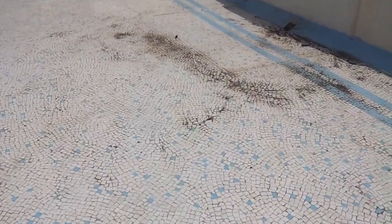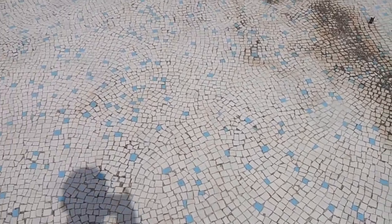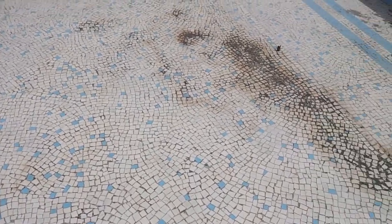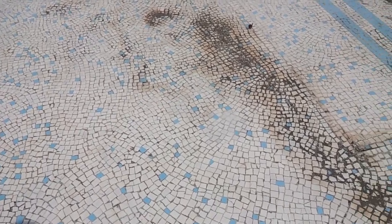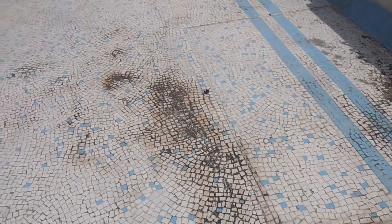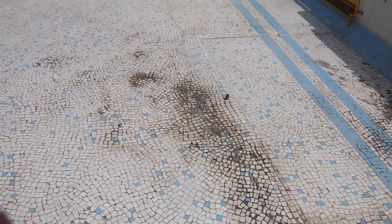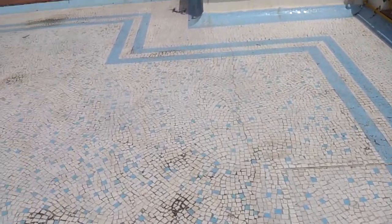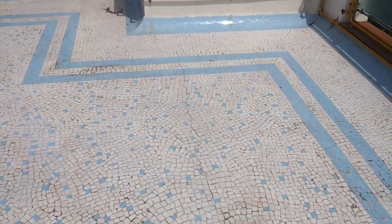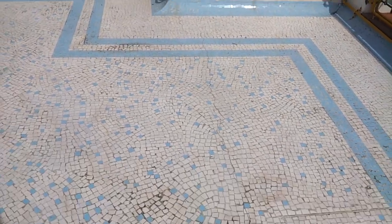As you can see, this is a huge terrace, and appropriate joints are always necessary when you are tiling on such a huge place. Nothing has been secured and flexible waterproofing is also not done beneath the tiles, because of which there is too much water seepage beneath this floor, and false ceilings are falling off from the roof.